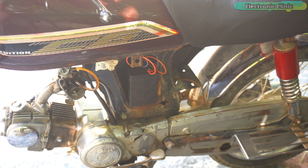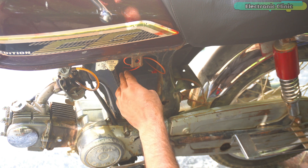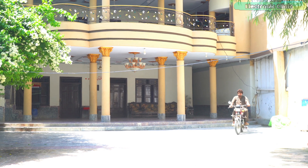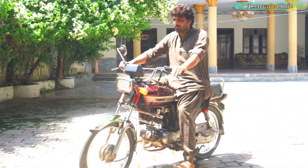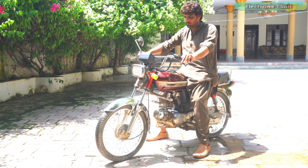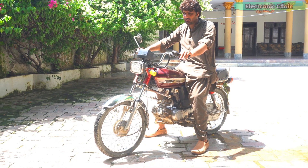Let's try bypassing the security system by disconnecting the battery wires. The battery wires have been disconnected and the switch is already on, so let's give it a push and see if the bike starts. It won't start because once the anti-theft mode is activated, it can't be reset. They will have to completely remove the controller board and rewire the connection, which might not be possible for the majority of thieves.